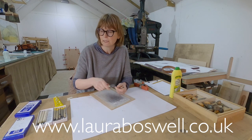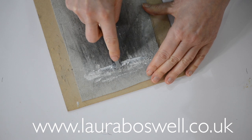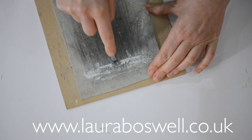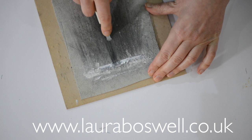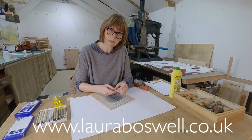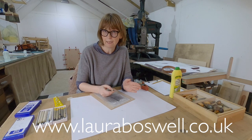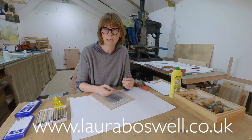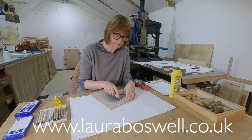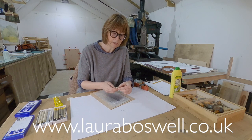Starting with the flat chisel — put it at the angle of the slight tilt at the end of the blade into the paste, then just pull it firmly down the leather towards you. You need to do this a few times. If you've got a new tool you'll be able to see it change from satin to mirror, and you'll know you're doing it right. Just a few strokes down the leather — don't rub it up and down or you'll cut into the leather, just pull down towards you firmly.